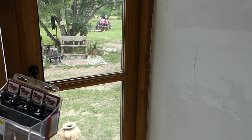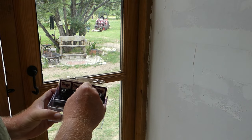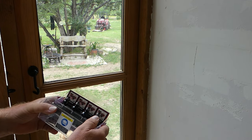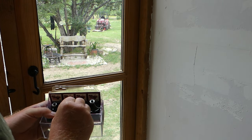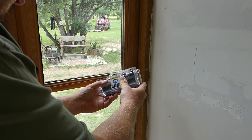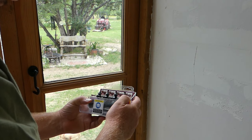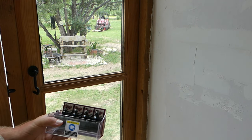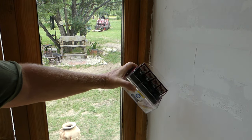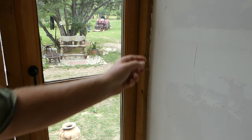Well, let me see here. My little hand router, let's find one that will make a nice little bevel. I think that one would do that. It's not the same, but a little rounded edge, it'll be all right. Let's do that. I just want to drop down the weight of it and not have a big, thick weather strip right there.